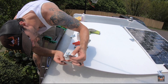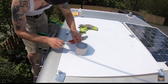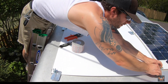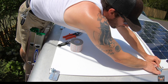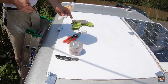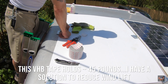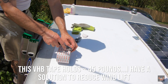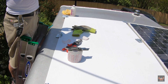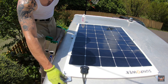The first thing we're going to do here to start putting this on the roof is map out where you want to put it, and then I start applying VHB tape, which is just super industrial-strength double-sided tape. I put that on the bolt head itself and also partially on the corrugated plastic, then pressed it down to make sure it was going to hold tight. I did that for all six of the bolts. You might be asking yourself if this is going to be enough to hold it down and keep it from lifting off with air — it should be sturdy. We're going to use some Eternabond here in a little bit to help secure things and keep water from getting underneath the tape and weakening it. But I also have a little trick at the end of the install to help keep that panel securely on the roof and keep the wind from getting underneath of it.